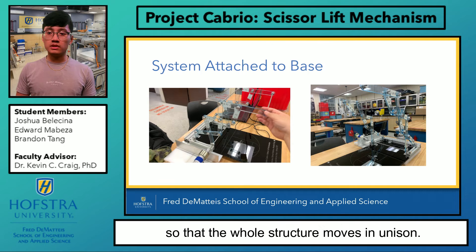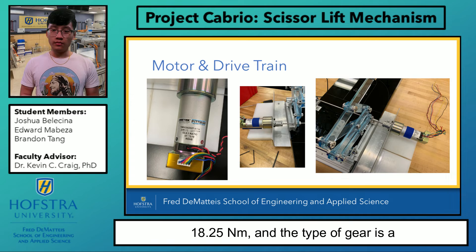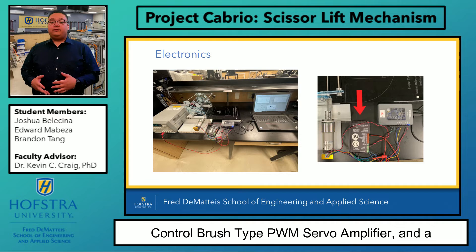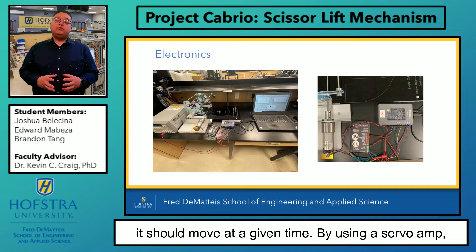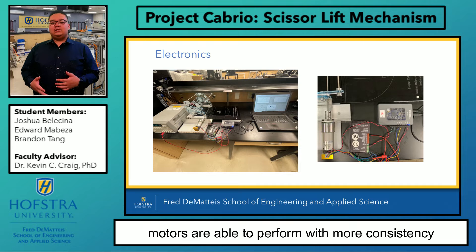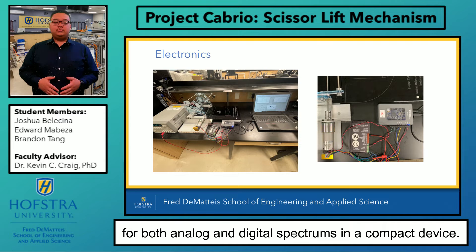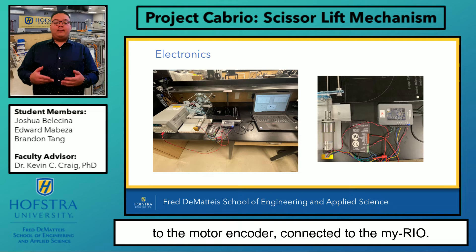Here are the specifications of the motor used in our project. It has an output voltage of 24 volts, a continuous output torque of 3.39 Nm, a peak output torque of 18.25 Nm, and the type of gear is a high-torque spur with a gear ratio of 65.5 to 1. The electronics we used are an advanced motion control brush-type PWM servo amplifier and a National Instruments myRIO. A servo amplifier transfers signals from the command module to the motor, effectively telling the motor how much it should move at a given time. By using a servo amp, motors are able to perform more consistently, meaning that the trajectory and overall motion is smooth. The National Instruments myRIO is a reconfigurable input-output device for both analog and digital spectrums in a compact device, similar to an Arduino microcontroller — the brains of our system. Our wire configuration goes from the power to the motor encoder connected to the myRIO. The myRIO connects to the servo amp, and then the servo amp is connected to the motor.